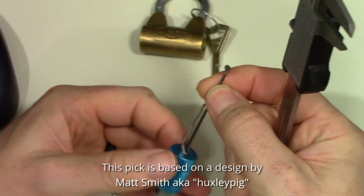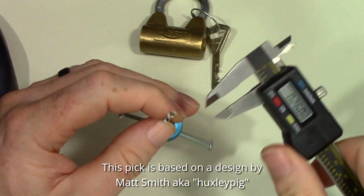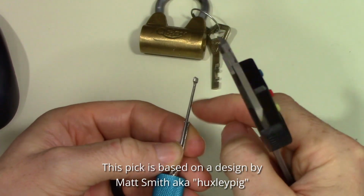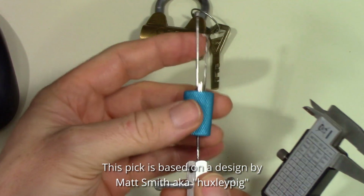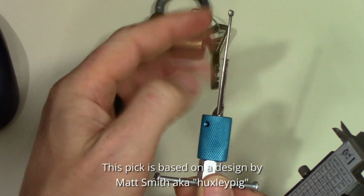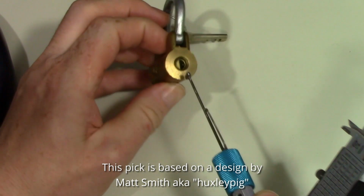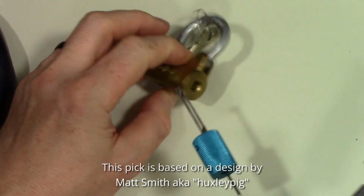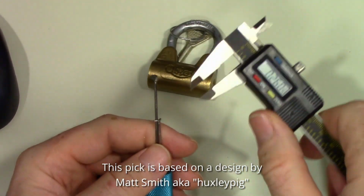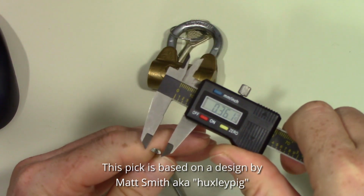The tension head. This is where the bulk of my mistakes are. I was afraid of the shaft interfering with the picking head here, so the shaft is off center a little bit towards the flat, and it really should have been the other way, because I ended up having to grind a bunch of the shaft off so it wouldn't catch on the other wheels. It really should be back further towards the curved part. But the dimensions are going to be pretty much the same as the pick head, because it's fitting the same.